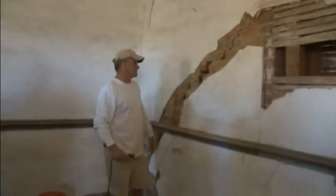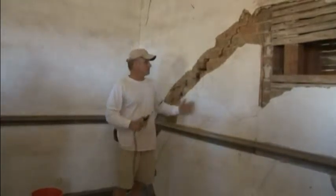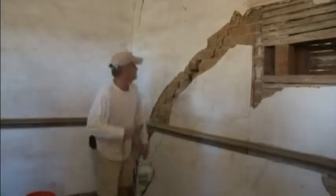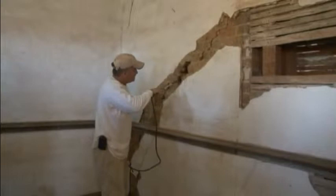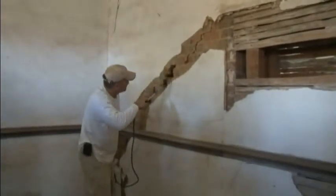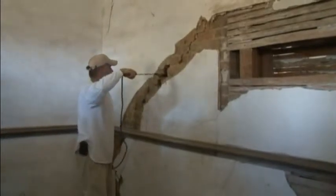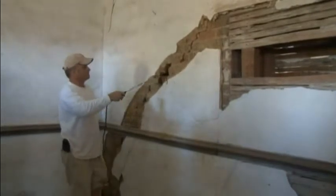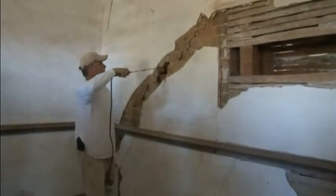I said earlier that I would start low because I don't want it to flow out. It doesn't appear that anything's going to flow down the walls here. You can see there's no water really running down the side — that's the brick sucking in all that water. So think of that in terms of if mortar was there — it's just drying it out. So we want to get that nice and wet.